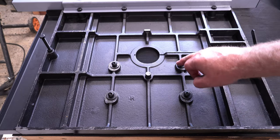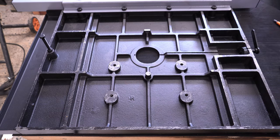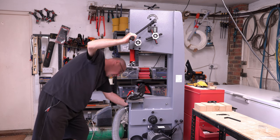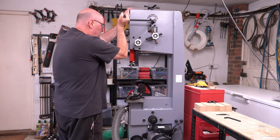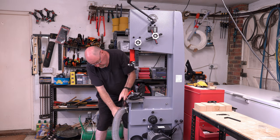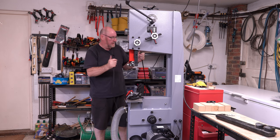The next thing is to fit the table. There are four hex screws and washers to remove with the provided allen key. To fit the table I've got to remove the blade first, as it would stop me. Opening the door, I use the release lever — pushing that up takes the tension off the blade, which is really quite handy. I remove the blade and slide out the piece of wood in there. The blade took some getting off because the wheel protrudes past the little groove in the steel, but I've got it out now.